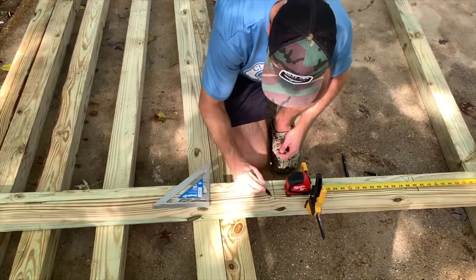I always recommend that you have your shed window on site so that you can perform a dry fit and make sure that everything's going to fit perfectly before you permanently fasten everything together. It just makes sense. After confirming fit, go ahead and tack in all of your window's framing with a framing nailer as you're seeing here. If you want even more detailed information on how to frame a shed's window, I have a blog linked in the description as well as a video above that will go through it in a greater level of detail.